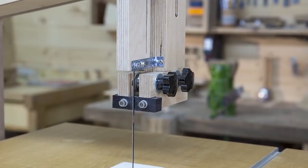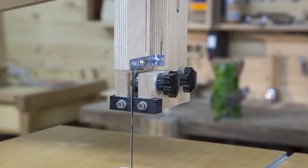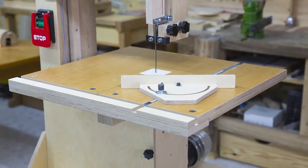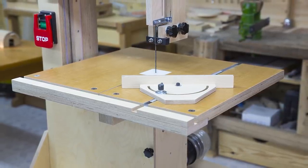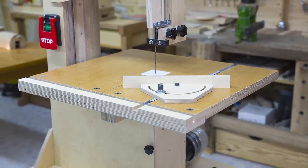Back when I built it I used Teflon to make the blade guides, but I don't think this material is hard enough for this purpose. I've also noticed the table is bent because of all the tension it has withstood, due to it being made with two plywood pieces glued together and an HPL sheet.